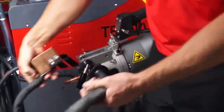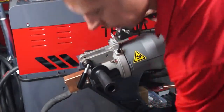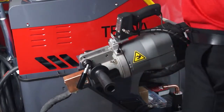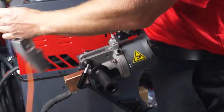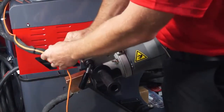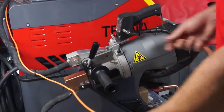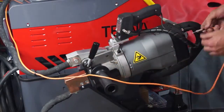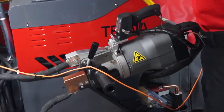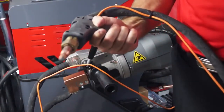Connect the single-sided welding cables. This block fits into the electrode and connects to the car. Connect the cable for the pistol gun. Lock the connection in, and connect the trigger switch cable to the back of the gun. We're ready to do single-sided welding.